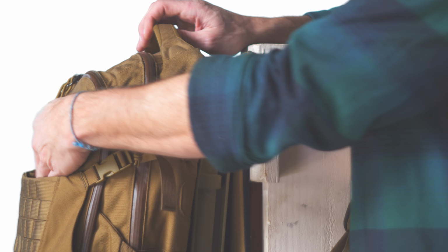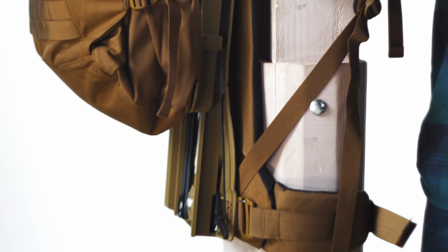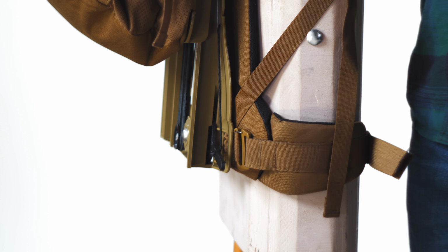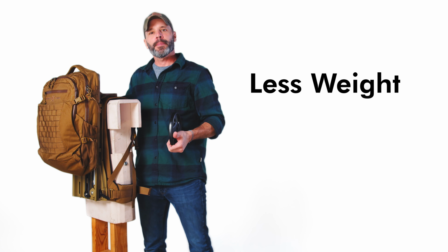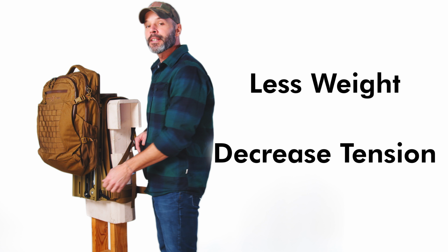Now if we remove the 5 pounds, there is too much spring tension, and the moving frame is pulled up towards the top. In this case, you would have to release some of the spring tension. This is done by pushing the lever down past the horizontal position until you hear the release or see the load move.